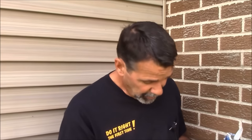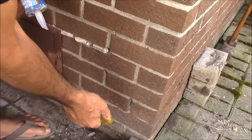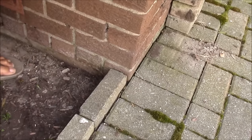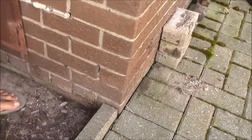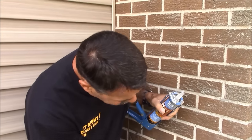A couple things to know. At the bottom of your bricks on a house — this is not a house, this is just a chimney sitting on a foundation — they'll leave gaps like this gap here at the base of your bricks. What that's for is for moisture to be able to drain out of a chimney when it gets behind the bricks due to hairline cracks, fissures, anything that allows moisture to get in the brick. It allows it to drain out at the bottom. Do not caulk up the bottom holes of your bricks — you want them to be able to weep. Matter of fact, now that you know they're there, maybe you'll clean them and hit them with a hose once in a while when you're gardening.